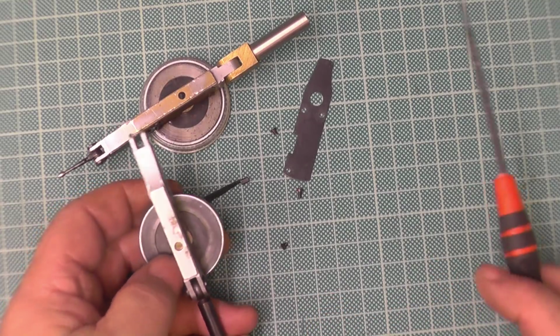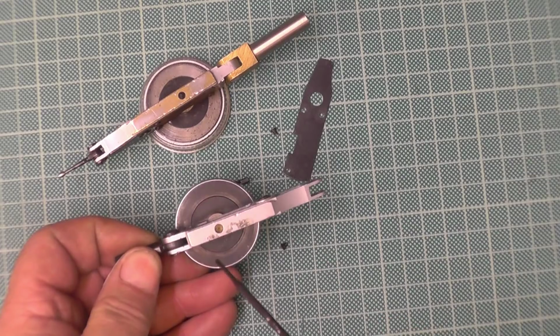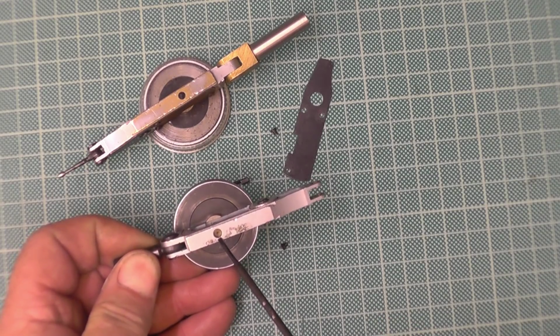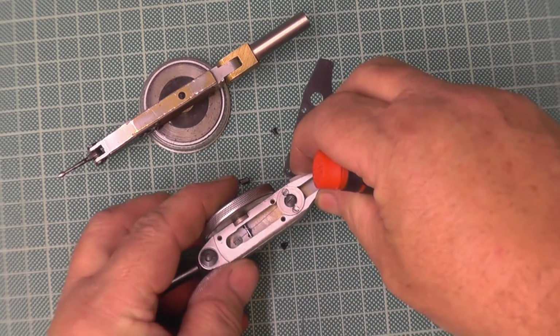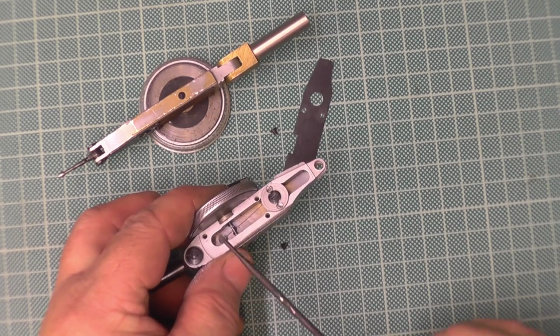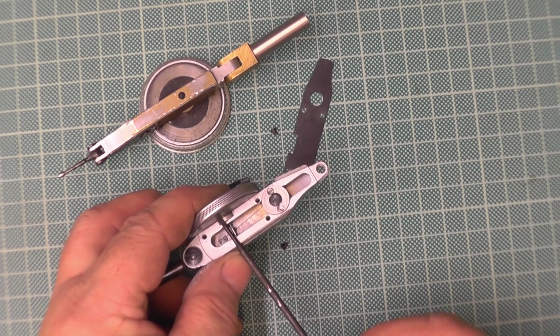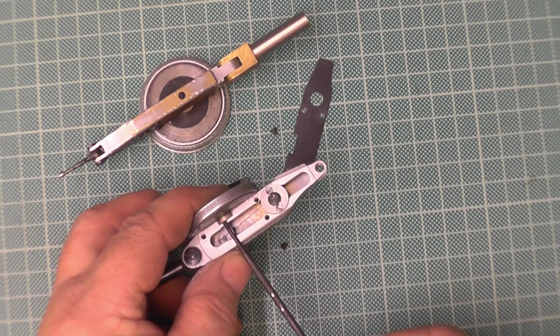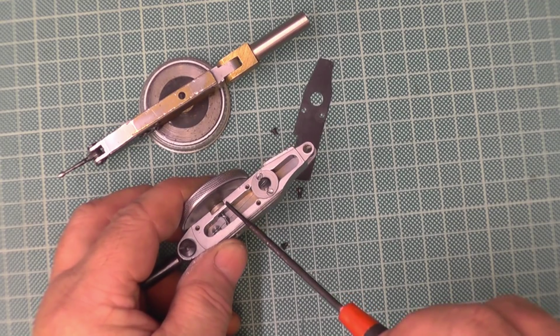They are a jeweled movement. They've both got jewels in. All of them have got jewels in. They've got a jewel in the bottom pivot, and they'll have a jewel in the top pivot. And just the same, pardon me, as with the big DTIs, in this little silver cup here, there's a hairspring. Just the same as the big DTIs, you have to put a pre-tension on that.